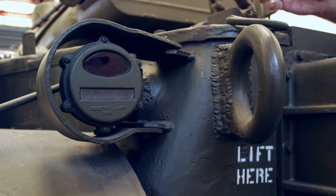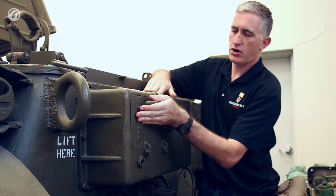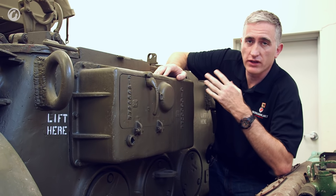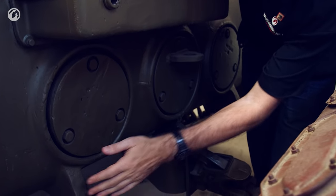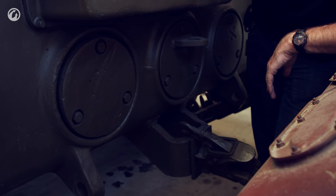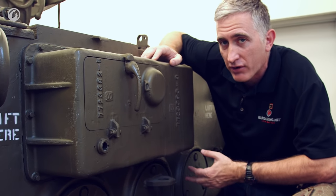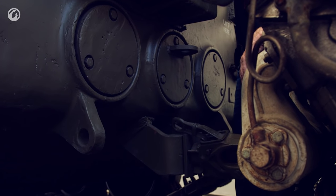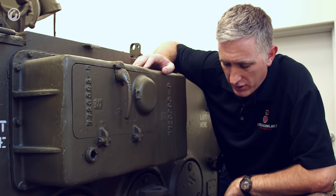At the back of the vehicle: rear tail light assembly, a lifting eye, and the box for the infantry telephone — which partially opens and has been removed from this vehicle. Moving along, the central access door is used to reach the transmission, and the two on either side are brake access doors. Further down are lugs for towing clevises and a pintle for towing trailers. Towing trailers from tanks was a bit of a 1950s fad since petrol engines gave terrible fuel economy — the best was probably the mono trailer for the British Centurions, but none tried by the US Army were found acceptable.